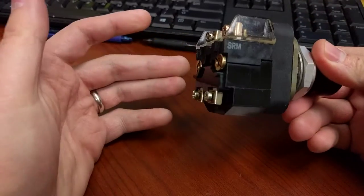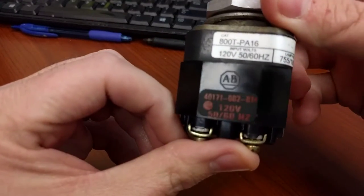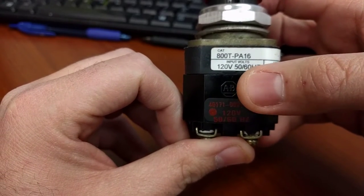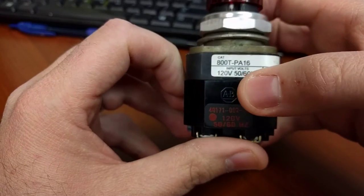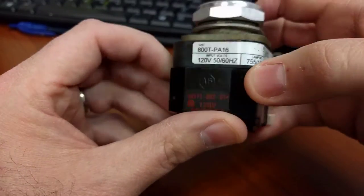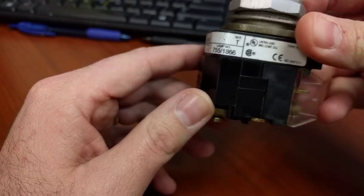It also is lit up, so it saves you space because you can run power to one side. In this case, it's saying I need 120 volts — this is saying that I need a 120-volt socket with this type of frequency range. That's a dead giveaway that this is AC; it will say VDC if it was DC. It gives you a lamp replacement part number, so you can go right in line and figure out all the things that you need.